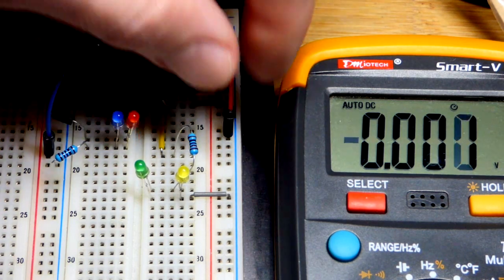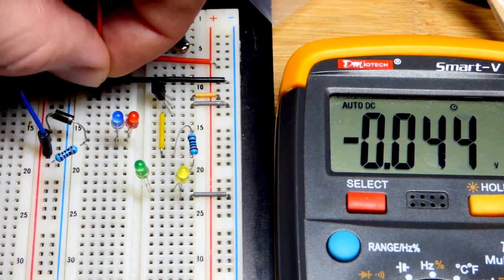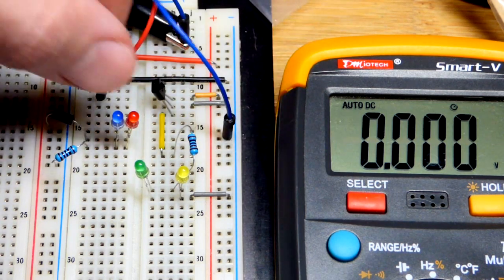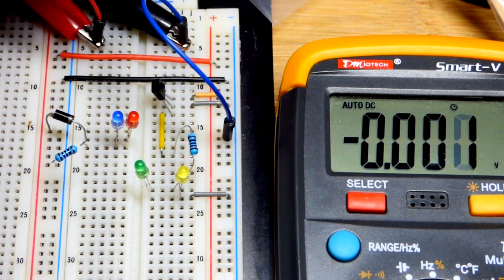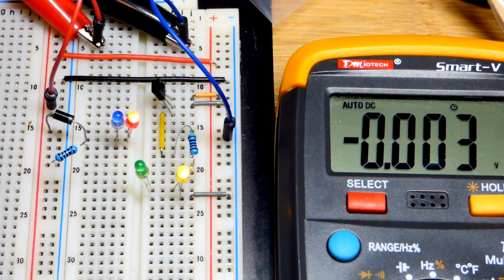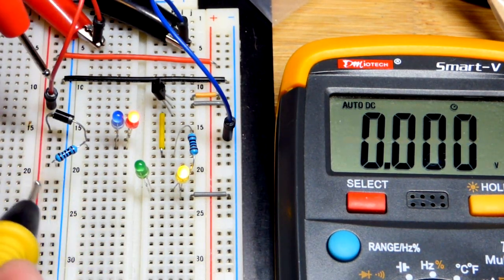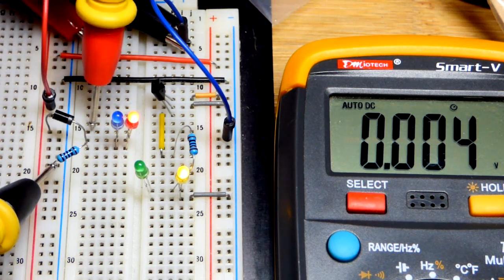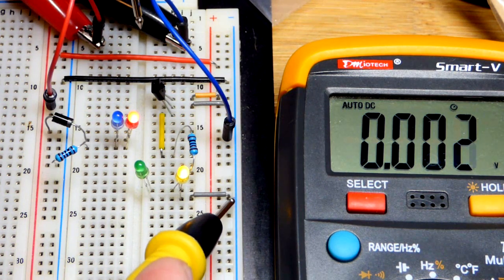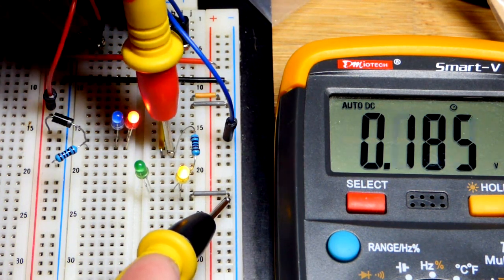But that's not the main advantage. Well, it is forward biased. That is the main advantage. So let's go back to blue being on the negative rail and red being on the positive rail, and we got them lit up. Now we don't have that diode drop. We have the diode drop here, so we lost almost 0.7 there, whereas this one we didn't.